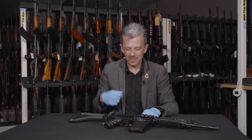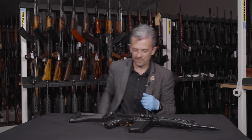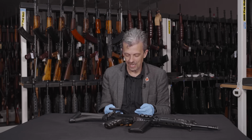So, in terms of what's wrong with it, let me read from my colleague's inspection report. We have piston and spring deficient, hammer, spring, housing and stay deficient, firing pin retaining pin distorted and stiff to remove, firing pin spring weak, not original spring, extractor spring weak, barrel puckered either side of gas block. As I mentioned, the damage to the barrel. End of hammer is badly bruised by contact with selector shaft. Recoil springs weak/incorrect pattern. Body locking catch spring too long, replaced.